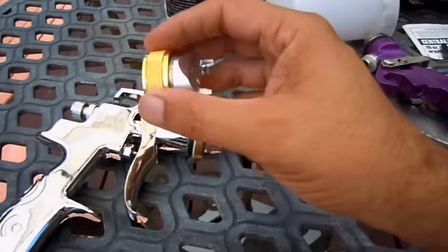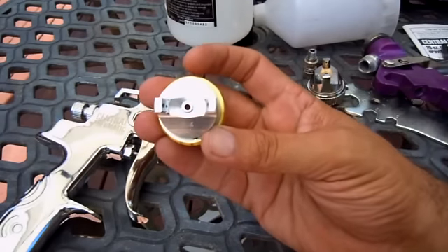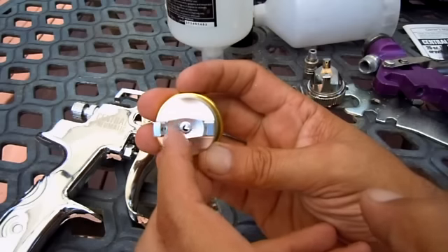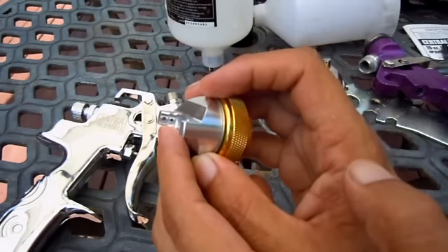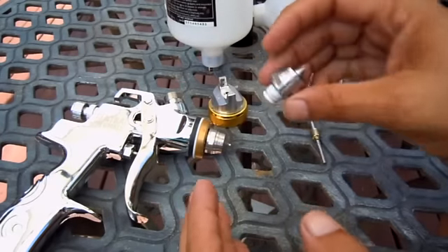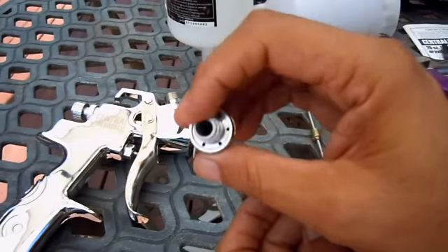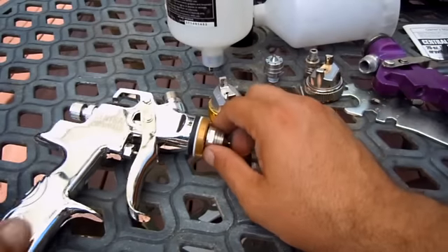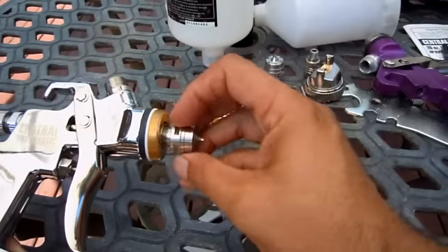On the professional gun, the aluminum has a nice anodized aluminum collar. When you look at the nozzle you're going to see a lot more holes for airflow, which gives you a finer mist. You have two vertical holes and then three on each side — very small holes — giving you a total of eight passages. The sides are stepped rather than smooth like the other one, with two on each side. The tolerances, machining, and threads are just so much nicer.